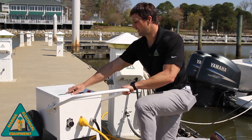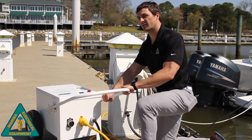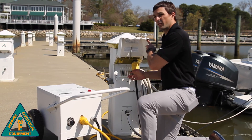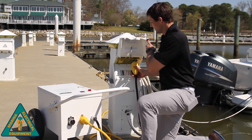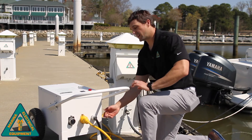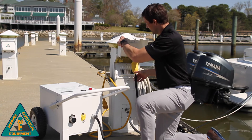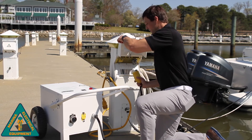After the test has been completed, we'll go through the shutdown procedure. First, de-energize the vessel main. Then work back and de-energize all the circuit breakers on the vessel ground fault check unit. Finally, de-energize the host power pedestal circuit breaker, unplug the vessel, and unplug the vessel ground fault check unit.